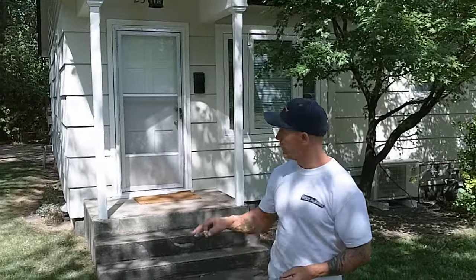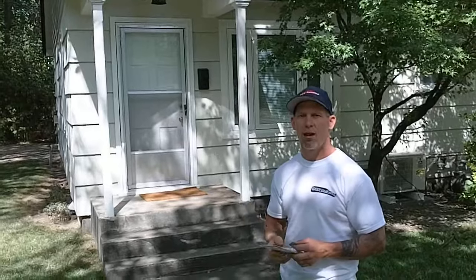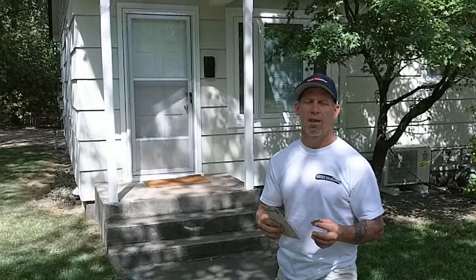We've got a house behind us here in the north end of Boise. These homes are 50 years old or older, so they fall into the time frame where lead could be positive in the paint. You don't want to do any sanding, scraping, or prep work prior to testing for lead, because if it's lead positive there are a lot of rules and regulations you need to follow by the EPA regarding proper prep and disposal of lead.